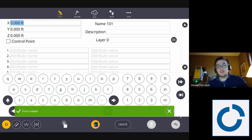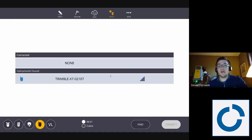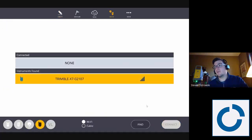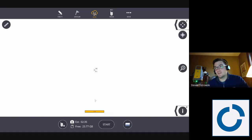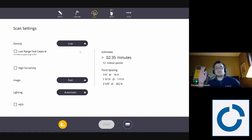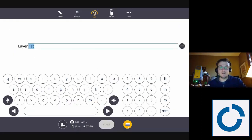What I'm doing now is creating a zero-zero point so I can align these scans and know my base coordinate, which I can set to what I'd like within the room or house. If I had a model or a PDF, FieldLink allows you to bring in any 2D or 3D model and align your scans to the right coordinate system. In this case I don't have one, so I'm going to set north going in, do a fast low capture for indoor scans, and set the layer to first.